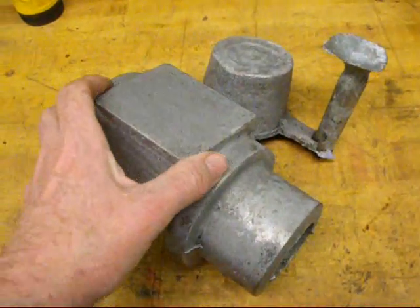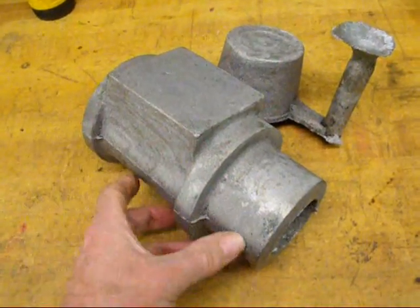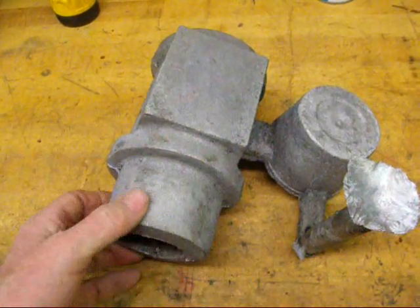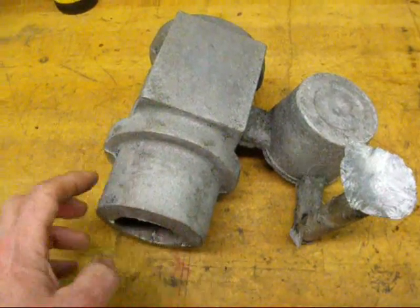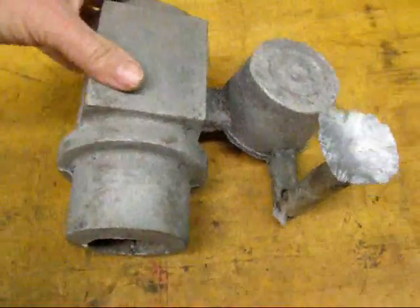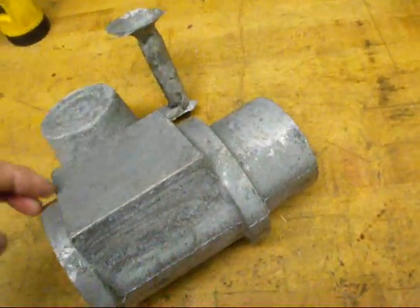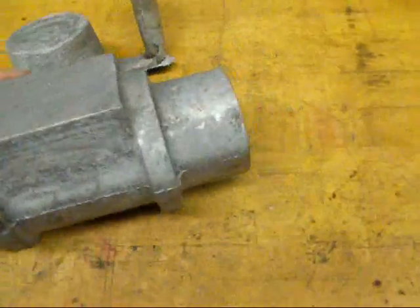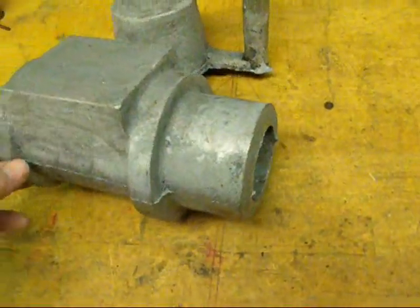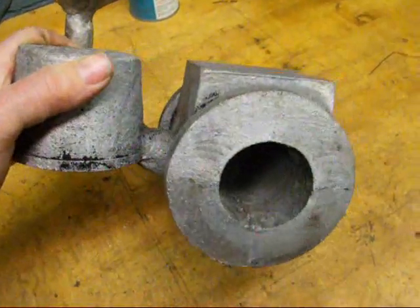For those of you thinking I didn't show the sand mold and how that was done — that was done in one of my other videos. This is a very similar process even though it's a bigger casting. The part I'm holding with my hand here — remember that's all waste stock. That's just to hold it in the chuck while we do the boring of this end, then that will be sawed off and this end will be faced. I think I made it quite a bit longer than what I needed to, but I'd rather have a little extra.